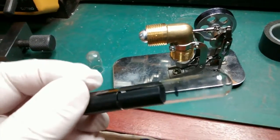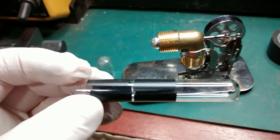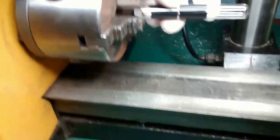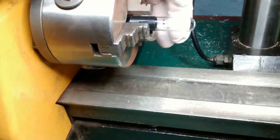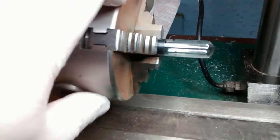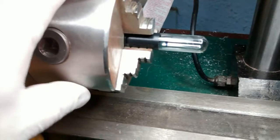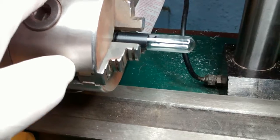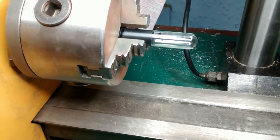I have wrapped electrical tape around the test tube and I am going to just mount it in the jaws of the vise or the lathe so I can just get a grip on it. You can see I have already marked where I want to cut, and I will be using a diamond file to cut that off. When I get everything ready I will set the camera up and we will see it cutting.